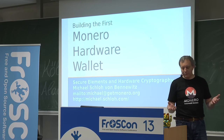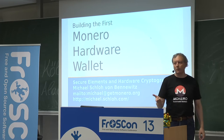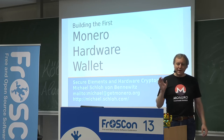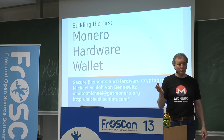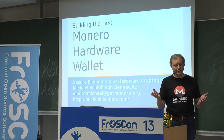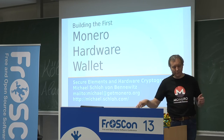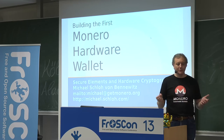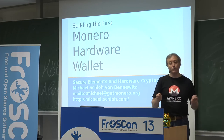You're able to develop firmware for almost any of these, for example, Shift Devices, Bitbox, or what's the other one, KeepKey or something, Coin Kite, Trezor, Ledger. But you have to be careful with the hardware. Ledger, for example, uses a Cortex M0 microcontroller. So it's so weak that if you do any kind of cryptography with it, if you're trying to generate keys of a certain length, you have to do that in software on the host and then encrypt it and send it over USB, have things on the microcontroller and then send results back. It's a different procedure. What we have is a generic hardware that we make special through the firmware design.